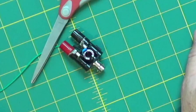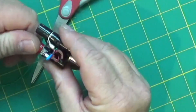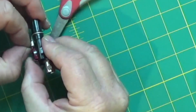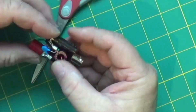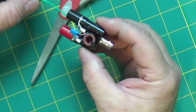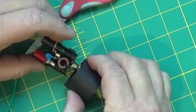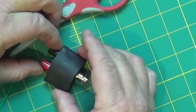I've got the capacitor on both legs — that's where it goes. I've got it just kind of in there, and I'll trim stuff off later and bend it down once I get it soldered. So let's just get everything soldered — it's really hard to crimp this, but we'll get everything soldered. It flowed in there pretty good. So I'll just back these off a little bit while it cools. Basically I'm just going to take this now, make sure it's not touching anything it's not supposed to, and just kind of bend it down in there. Basically you're done — your antenna comes out here. Let that cool off, and then you can throw your heat shrink over the top. It would be just like that — heat it up. This is inch and a quarter; you can probably get by with one inch heat shrink.